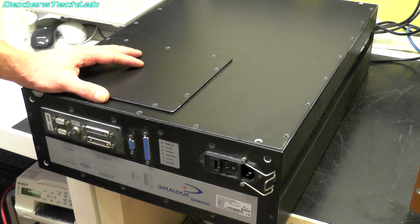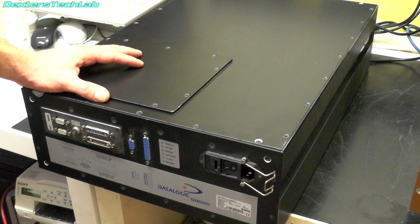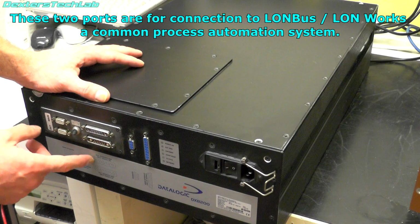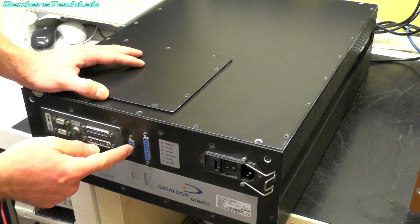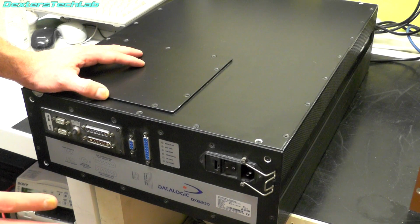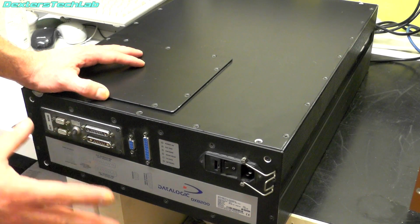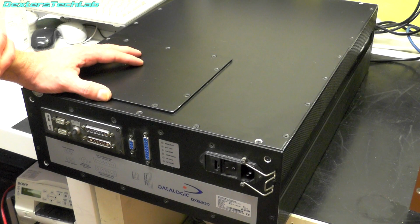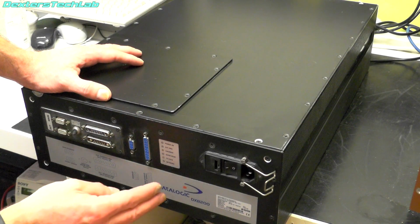So the connections on the front here, these are fairly logical things. We've got main interface, that's probably an RS-232 port. Output signals, there's probably some switch outputs to say I've read a barcode correctly or something like that. We've got auxiliary inputs A and B, and we've got this port here reserved. I suspect that is a diagnostics port. I do have some user guides for, not this specific one, but very, very similar products in the range, and they do have RS-232 serial diagnostics. We've got another connector there, main interface and input-output signals. So I'm not sure what that is different to these.